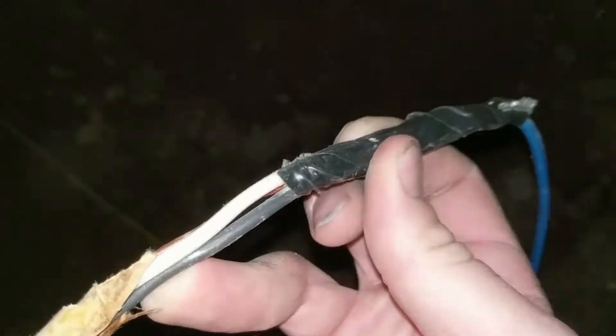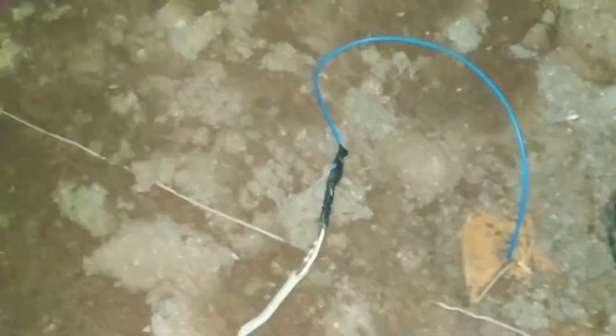I've located the Romex that goes down to the bedroom. Now I just want to pull it up until I see the cat 5 — and look at that cat 5 cable. Now I want to undo my tape, pull up a bunch of the cat 5 cable, tape the Romex back to the cat 5 cable, and pull it back down into the bedroom.